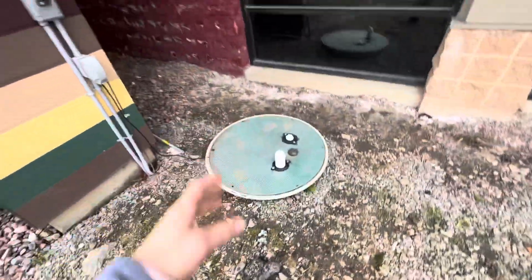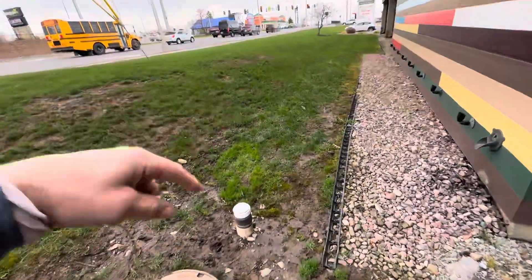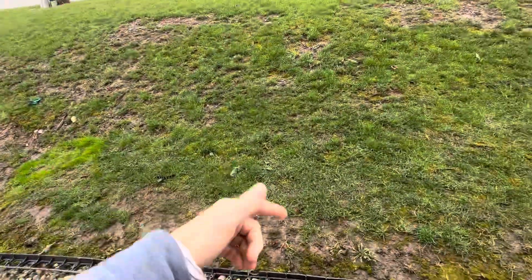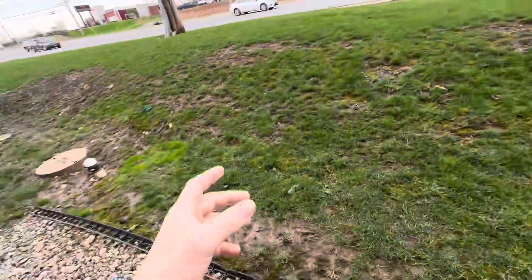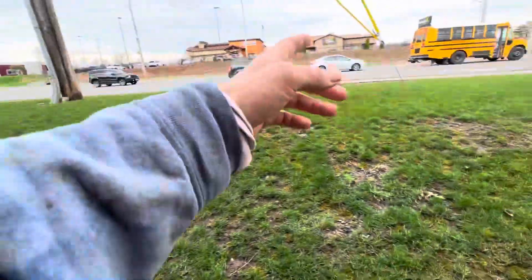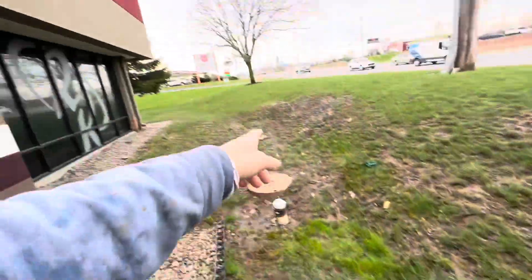You could just keep this pump station for the sewage and then add another smaller pump station over here to handle the grease trap. If you have a check valve on your pump, it's not going to allow the sewage to come back in through the grease trap.